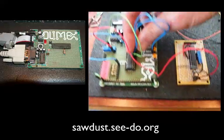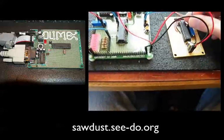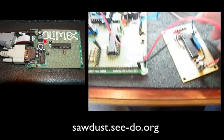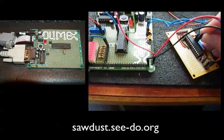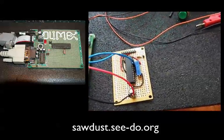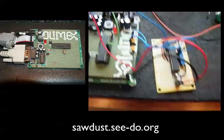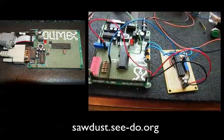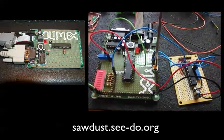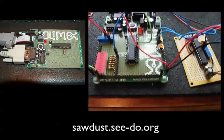This is how I test that these circuit boards are working correctly. I've powered that up, and now I'm going to extract the ADC inputs and transfer them over to this board. I'm plugging these into the same ADC port on this board. I don't have a second LED right now, so I'm using the debug LED for the interrupt. I've got this board powered parasitically. Turning it up — you can see the LED on the very left fire. Same with the second sensor. That way I can test to make sure the board is working.